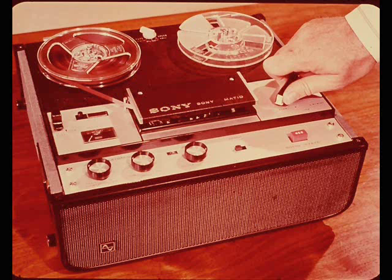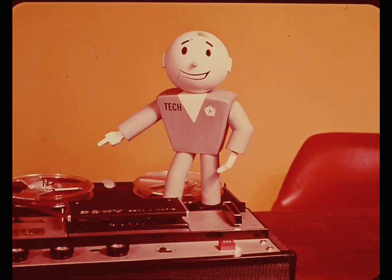To further emphasize how pinion depth can cause rear axle noise, here is a progression of the sound as the pinion moves out of the axle two thousandths of an inch at a time. It should be stressed that these gear sounds are not exactly the same as the sounds that would be heard inside a car — they merely demonstrate how improper pinion depth setting will create axle noise.